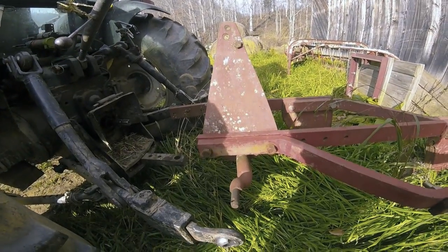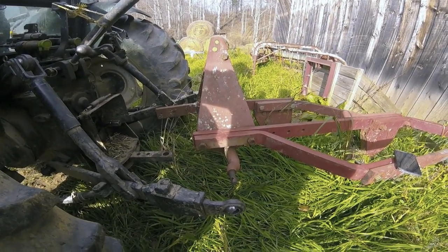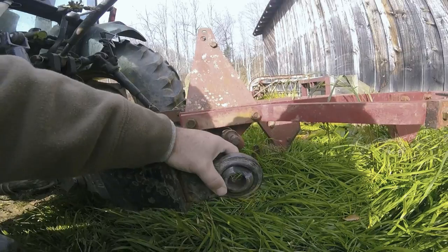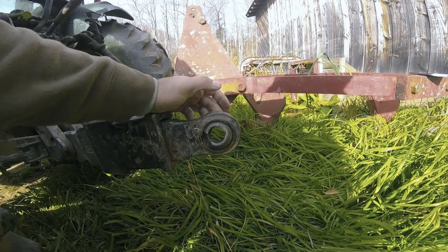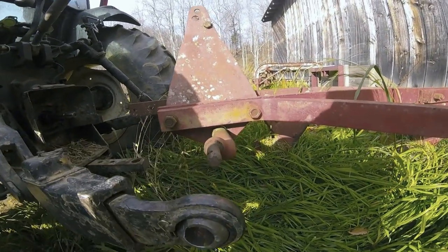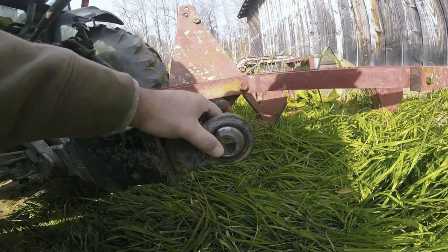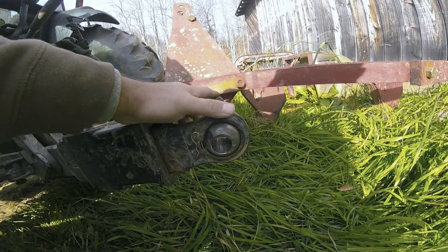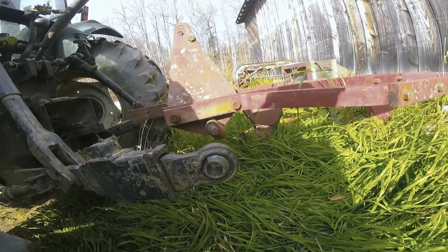It is November 25th, 2017, and we're going to start doing a little moldboard plowing this morning, but ran into an issue. The New Holland has category 1 or 2 lift arm balls. As you can see, that's category 2, and they're interchangeable. You change them out, and I got a set of category 1. Plows are category 1. The hookup on them are category 1, which isn't a problem. You can put a bushing in here, and I've got bushings. You can put bushings in there and use them. That normally would not be a problem. Well, here's the issue. Now I'll show you.